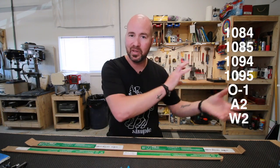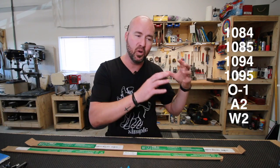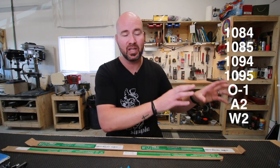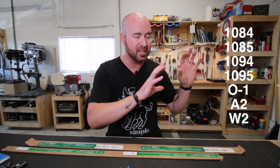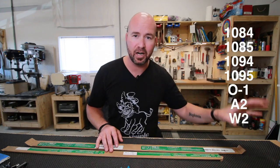So on this side of the camp, your right, my left, we've got high carbon steels, things like the 10 series of steels, 01 tool steel, other tooling steels, things that are generally easier to heat treat. Most new makers will start off with something in this camp, work from there, figure that out, and excellent tools and knives are made with steels here. Let's not ever confuse that. There are pros and cons to everything, but some fantastic blades that are going to be really good, long-lasting knives absolutely all day long in this camp of high carbon steels.